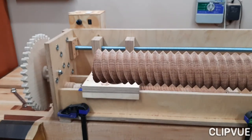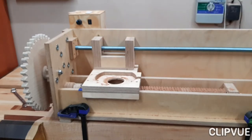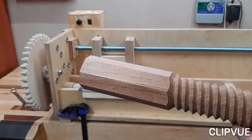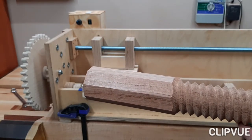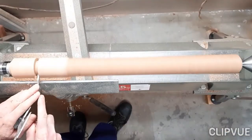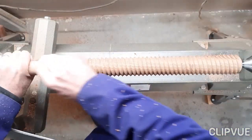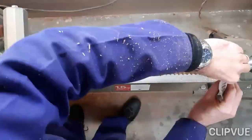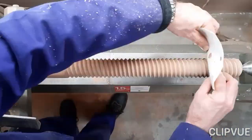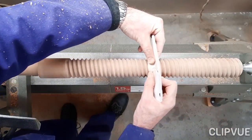The next step will be to take it to the lathe to sand the thread smooth a bit, and also to finish up the top part of the screw. Over here, just putting a chamfer on the front of the screw, rounding over the top section, making a tenon for the eventual hub, and then lots of sanding — even sanding the threads as well. And just some sanding of the threads in real time.